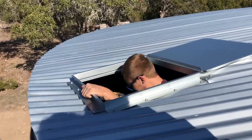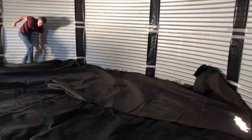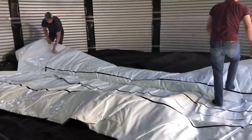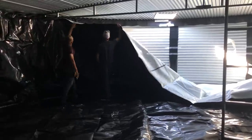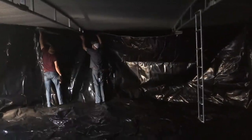A hatch was added with a ladder that drops down, and yes, I got inside too — when am I ever going to be inside my own tank again? It was surprisingly light inside and really cool. The first thing to do inside was to lay down a geotextile material to prevent things from growing up inside. Then the liner was unpackaged, unrolled, and installed — at this point it was a no-shoe zone. The liner is plastic but it's BPA-free and NSF 61 certified with embedded antimicrobial technology. This exclusive aqua liner is first attached to the bottom with built-in tabs, then all along the top. With my roof size around 3,700 square feet, it'll take about 12 inches of rain to fill this tank.